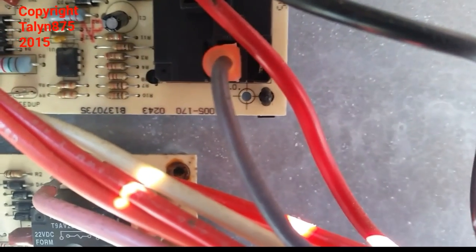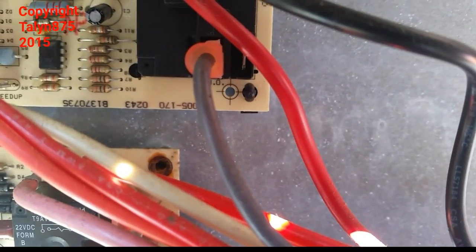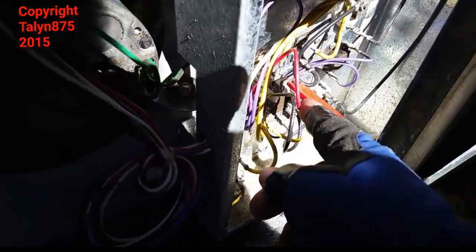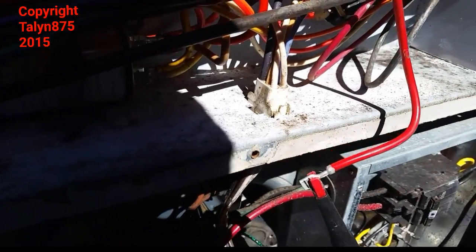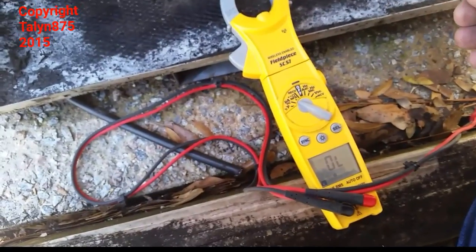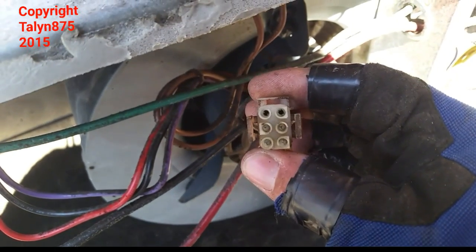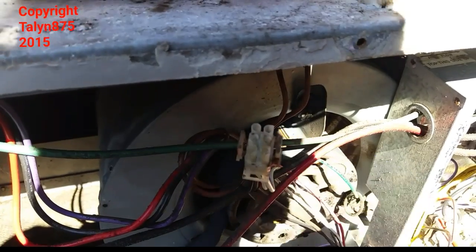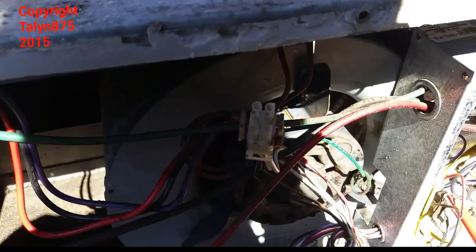There's nothing plugged into the blower relay terminal. When I hooked up my leads on the sequencer — red wire on one end and the other end of the red wire on the other — we should have had very low resistance, but we got an open line. The reason is a Molex plug where two of the pins have broken off — you can see the top two are broken off and stuck inside, or the other plug separated. That's why there's no connection. So we have miswiring and a broken plug to fix.